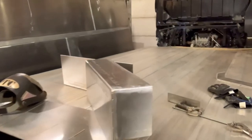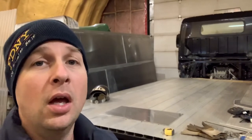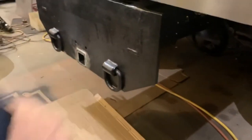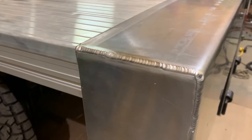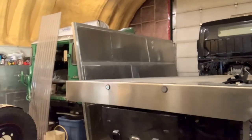I have to admit it's not perfect, but it'll do — let's take a closer look. Welding the other side is going to look virtually identical, so let's just look at them on the truck. Side number one, welded up in place — I'm going to cut that corner off on the same angle as the steel down here. Side number two, welded up. This is my favorite weld so far — I think that one came out all right. Not there yet, but we are getting close. I've done another bend and we now have three pieces across the back. Look at that — it's starting to look like a truck.